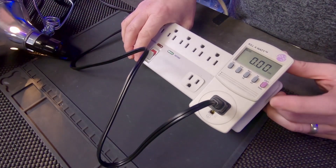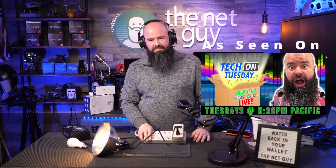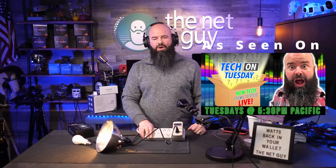Other cool things about this one: as long as it's plugged in and you go to this button over here, you can actually have it meter over time. It's been running for three minutes and used a total of 0.00 so far. But if I let this run for an hour, it's going to use 0.021 kilowatt-hours because it's using 21 watts for an hour. That's how all these meters work.